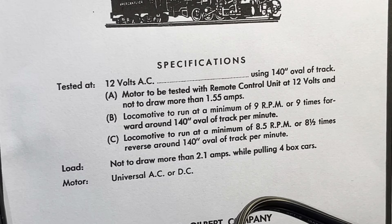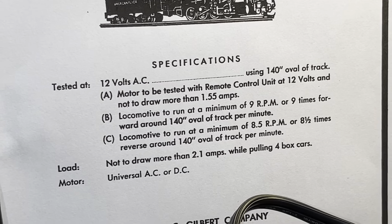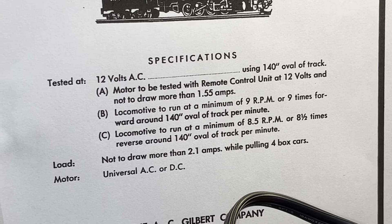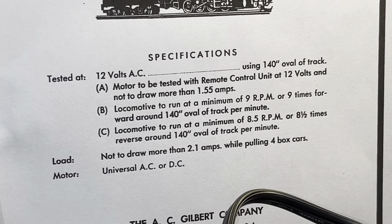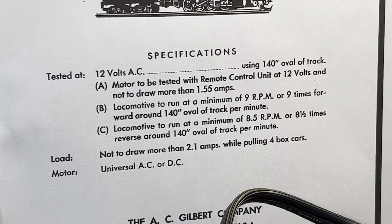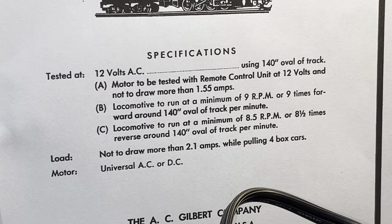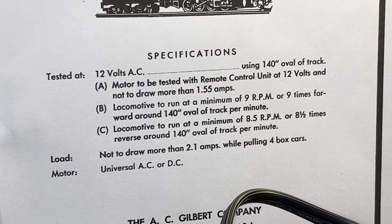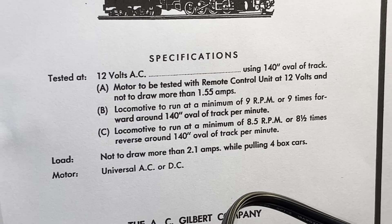Elevated heat, for example, could damage plastic and impact wire insulation, including the motors. The armature has already got the reputation of an inability to disperse heat, and it might just simply cause it to build up even greater heat. It can impact lubrication and could lead to a degradation in motor performance. Those are just some of the concerns.